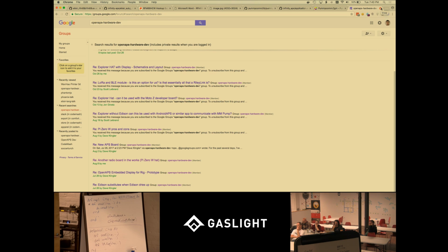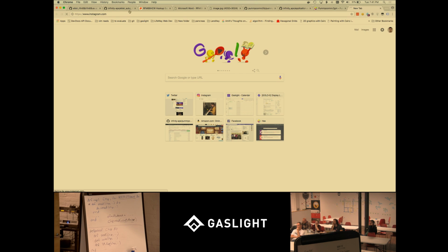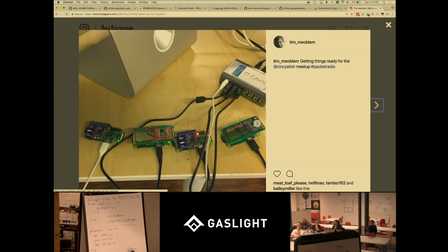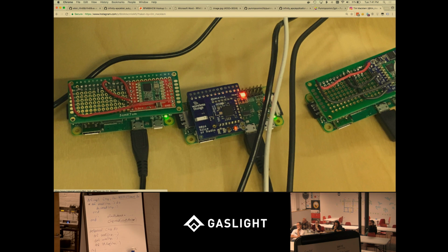And then you applied the nerves technology to the programming on it? This is risky. I'm going to Instagram. Let's see what happens. I just wanted to get a picture of the boards. Once I figured out the pinout of the different boards, because they've got some open specs on which pins are the reset and the interrupt pins and all that, I just prototyped it. I spent a little time in the basement soldering to the right headers, and these are really cheap prototype boards you can buy from Micro Center. So basically just figuring out the wiring and then making the chip that I bought from Adafruit look like the chip's going to look when it's on the actual commercial board, and playing with it until it works. That's a lot of trial and error, basically, the way I've been doing it.